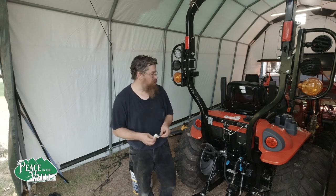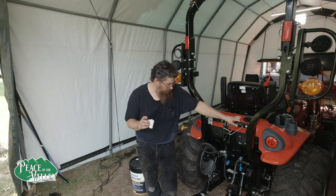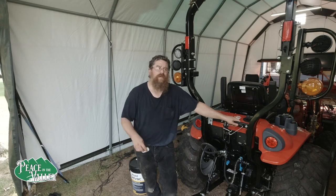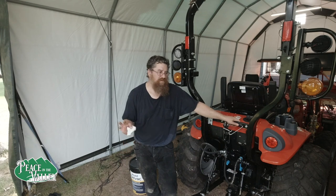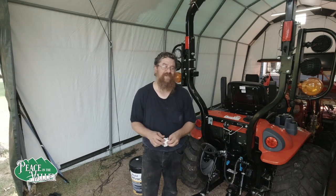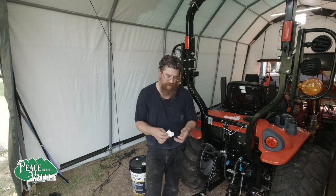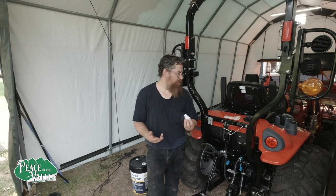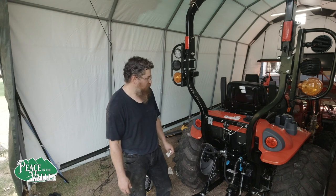We finished our 50-hour service. There's a couple things I want to bring to your attention, though. One, if I can remember now, because it's so darn hot. Oh, that's it. Don't do it on a day that's 95 degrees and 90% humidity. If you have to wait, plan on a day that's going to be cooler before you hit your number of 50 hours. I think I would also do it maybe a little before 50 hours if you work your tractor hard, which I think we do with digging tile. And so that is a couple things.